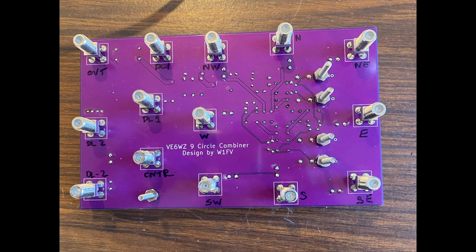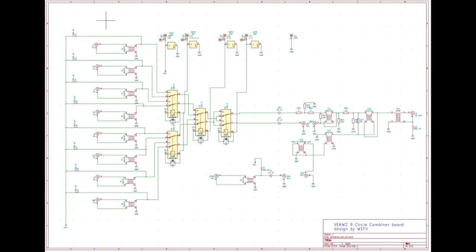Don't forget that the F connectors go on the back side of the PCB board as annotated with the white boxes on the silkscreen. You can see the VCC and control line number 8 stainless steel screws — I use lock washers on them. Remember that the enclosure has to be plastic. The entire point of this design is to isolate each RG6 line from each other: each F connector is isolated from the common ground plane on the board, and the CMCs isolate them from each other, so obviously a metal box would not work. The ground lug on the board is meant for a dedicated ground rod located right at the combiner box, and there's an RF choke on the ground of the feed line going to the rig to provide a return ground path back to the shack for the 12 volt line.